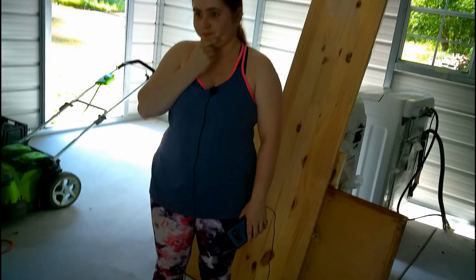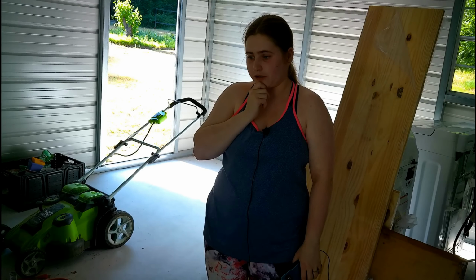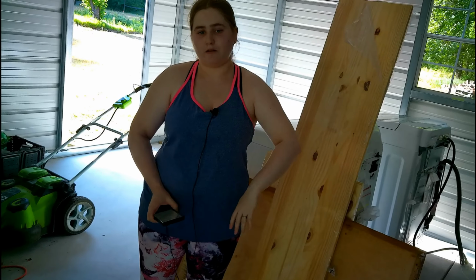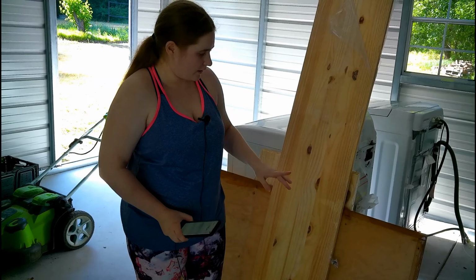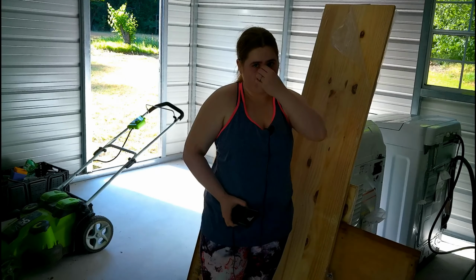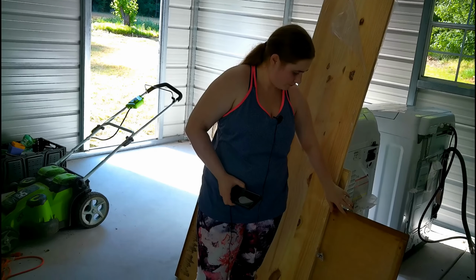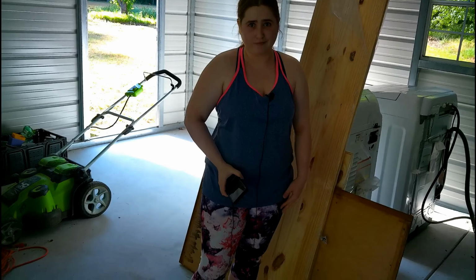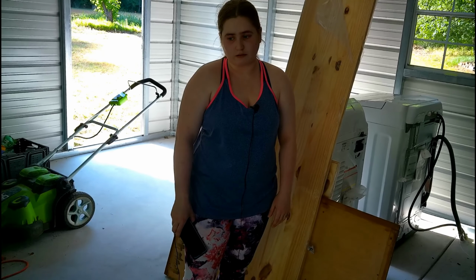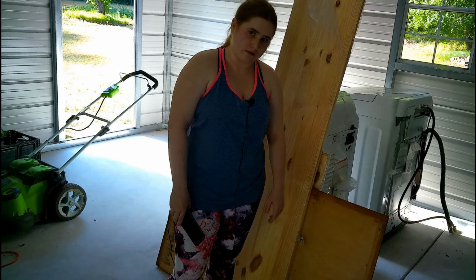So I know that we mentioned what we can and can't do with the wood on the drawer pieces. We retook our measurements for the top piece and the side panels off camera. We've decided that we're just going to account for these little buffer pieces, these edge pieces here and here. We're just going to add it into the whole panel on the top and just grind out the curve. We're just going to bevel it. Because this is just glued on or nailed on, it's going to be easier to add it into the main piece rather than trying to create additional pieces just to glue them on.